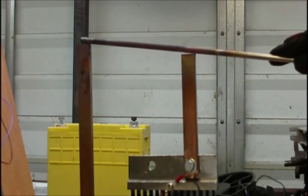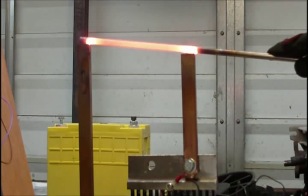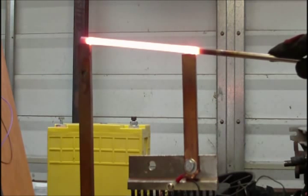So there's a piece of bar. There we go, 500 amperes. No, 520 actually, at 3.1 volts. Falling back to 3.08 volts. That's some serious current. 510 amps at 3.07 volts. And I can see the heat haze just coming up off this thing. It's crazy. 496 amps at 3.06 volts. So that's like a 500 amp controller full on.